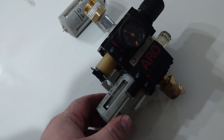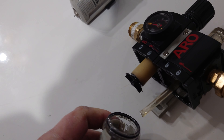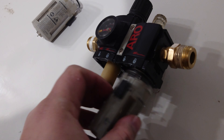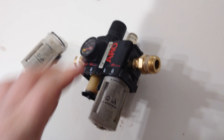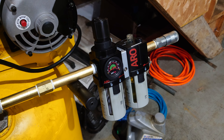The next thing we have is the oil fogger, which works pretty much the same way in terms of getting the cartridge in and out. You fill this up with tool oil, and then this little pickup tube sucks up that tool oil and sends it down the line so that your tools are always lubricated, regardless of your daily oiling needs. As long as you've got oil in this container, you've got oil to your tools. One less step to have to worry about with your air stuff.